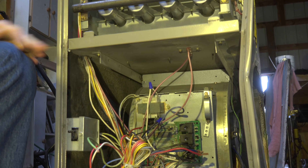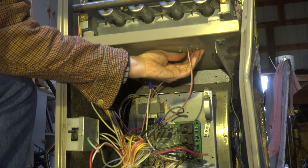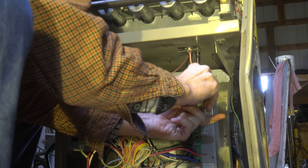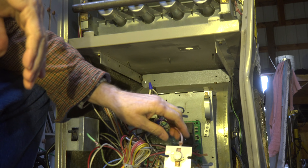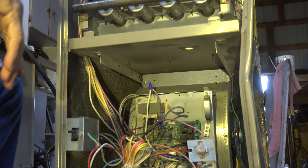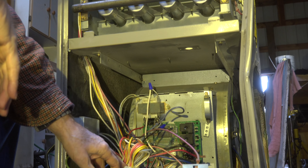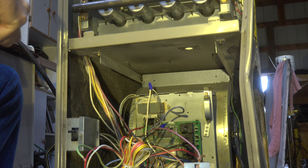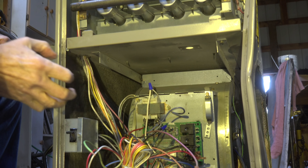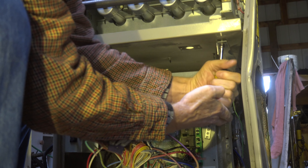Right here is a limit switch — actually a rollout switch — and I've got to take it out because when I slide the assembly out it's going to hit the switch. I'm not disconnecting the switch because I want to disconnect as few things as possible; the more things I disconnect, the more chance of problems. My next issue is this wiring bundle — I'm going to go ahead and cut that wire tie and replace it later. On some units there will be a plug you can just unplug, but this one does not have that.